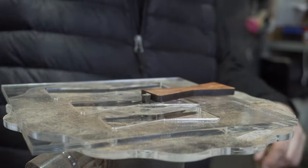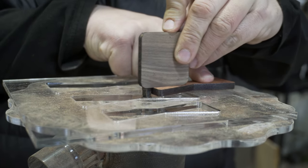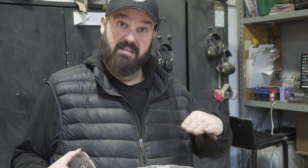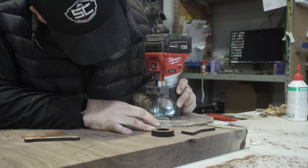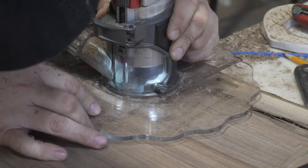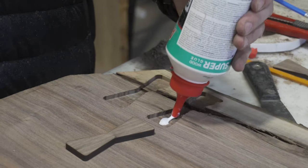Once I put my template tape on my template I can align it perfectly, so my bow tie is in the exact spot. I'm taking a different template, putting it over my router, then taking my bow tie and placing it up against my router bit to check that my router bit isn't sticking above my bow tie. I want to be able to go back and sand this smooth at the end, so I want my bow tie to stick up from my work surface a little bit.